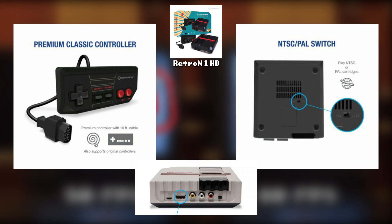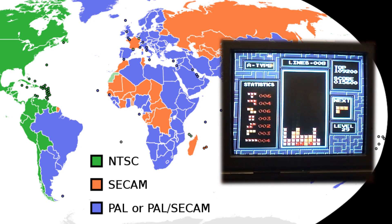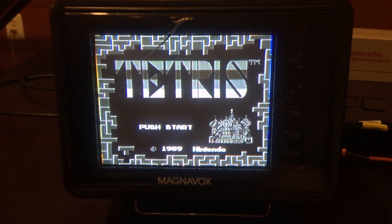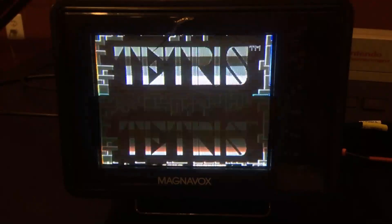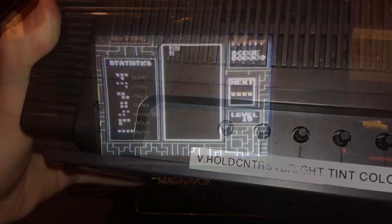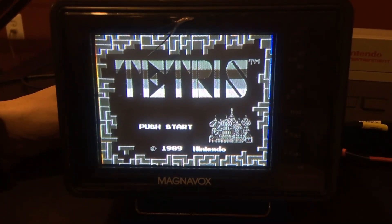Since most regions in Europe are PAL, another issue may be finding a CRT that works with the NTSC video signal. In general, three things can happen when you plug an NTSC signal into a PAL TV. One: the image will sync and be in color — this is the best scenario, meaning your TV is fully capable of accepting NTSC video. Two: the image will sync but be in monochrome, which may make the game harder if you rely on recognizing pieces by color. And three: the image just flat out doesn't sync, meaning your TV won't work with NTSC video at all. However, if your TV has a vertical hold control, fiddling with that may get the picture to sync, though you still won't have color.